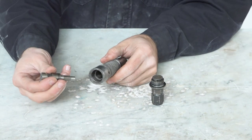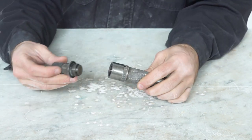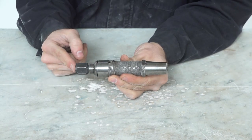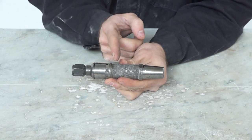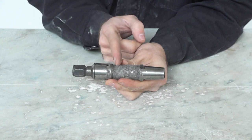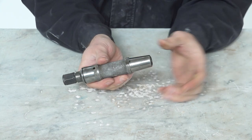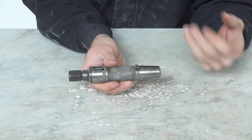So this is all there is to it - it's quite straightforward. The piston fits perfectly in here and then everything is sealed off by this piece. Air comes from here, meets the piston and pushes it very fast at an incredible number of times per second, and the tiny but very fast back-and-forth movements of the piston will strike the chisel fitted in here, which results in a carving action on the stone.